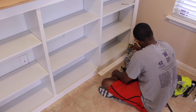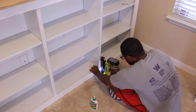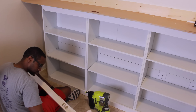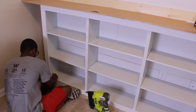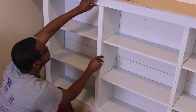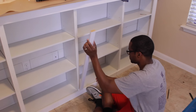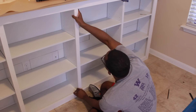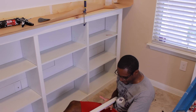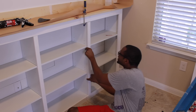This bottom piece is the most important part — because the bookcases you normally buy in the store usually have crappy legs or a very cheaply made bottom. By adding trim at the bottom it makes it look a lot more expensive and brings the whole bookcase together. Now Daryl's measuring and we're doing the trim in the middle as well — you can see the line where the two bookcases are put together, and putting trim there makes it look like it's all one piece.